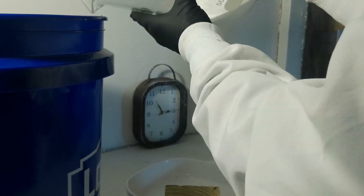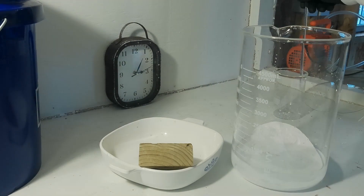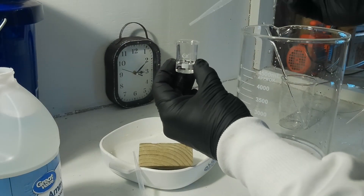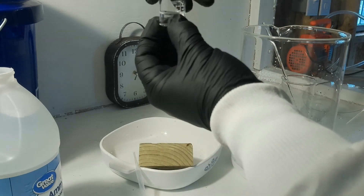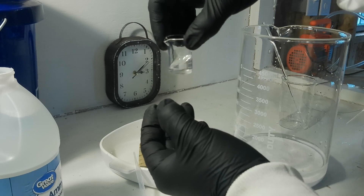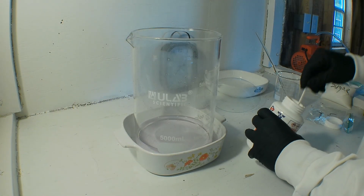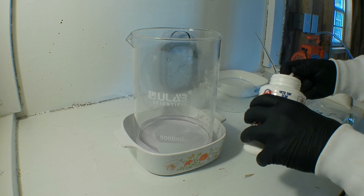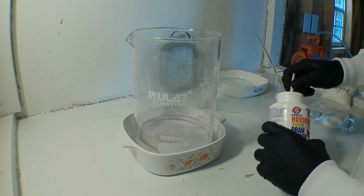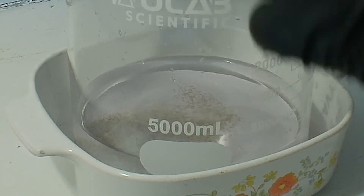And this is where I lose my light again. The copper test will turn blue. Now we take our silver chloride to silver oxide using lye — sodium hydroxide. When silver chloride turns to silver oxide, it turns jet black. So that's the color we're looking for. When all this is jet black, we'll know we're done.